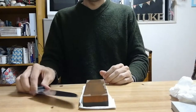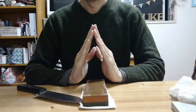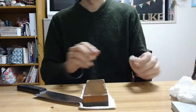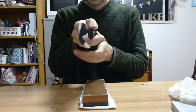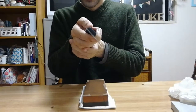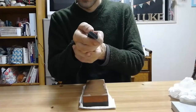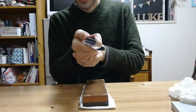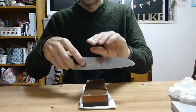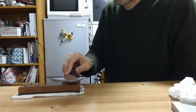What angle to sharpen at? A good edge is about 30 degrees. 25 degrees is about the minimum and 35 degrees is about the maximum I would go, so around 30 degrees is what you want. How do you find that? You can kind of do it like this: 90 degrees, half of that is 45, half of 45 is 22 degrees, and a little bit less gets you about 15 degrees. You can build an angle reference if you want, but honestly just hold it about like so to the stone.